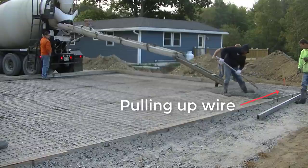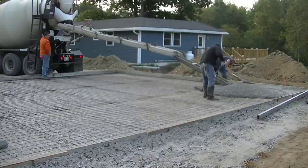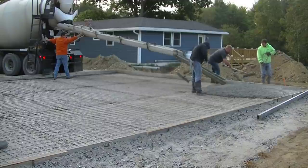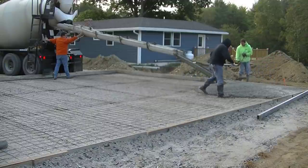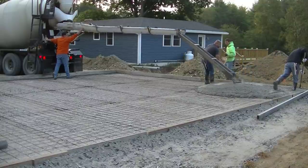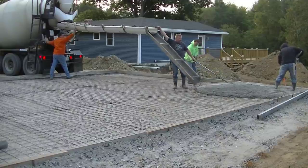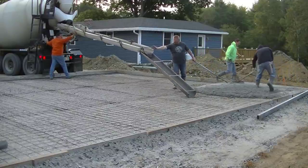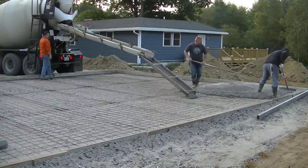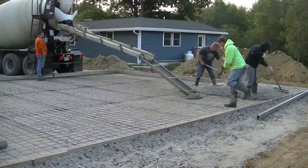What we're doing here is pouring concrete that's 3,000 PSI. It's got microfiber mesh in it and air entrainment, because we live in a state where we get a lot of freeze and thaw cycles and this garage isn't going to be heated. Those tiny microscopic air bubbles in the concrete help protect it from freezing, thawing, and moisture getting inside and popping and peeling the surface. We usually have about four to five percent air entrainment, put right in at the batch plant.